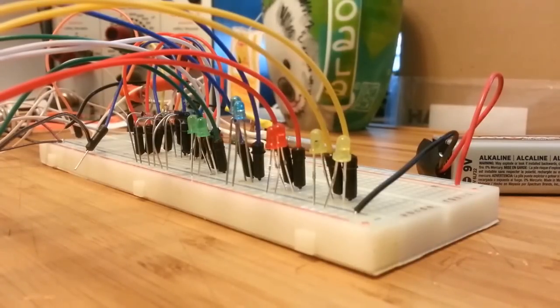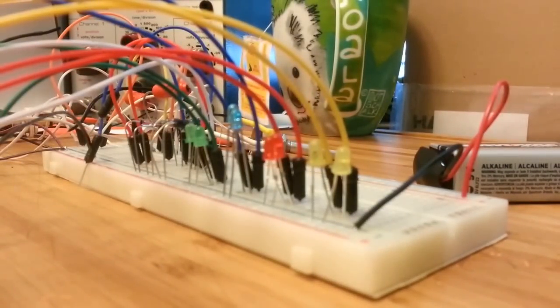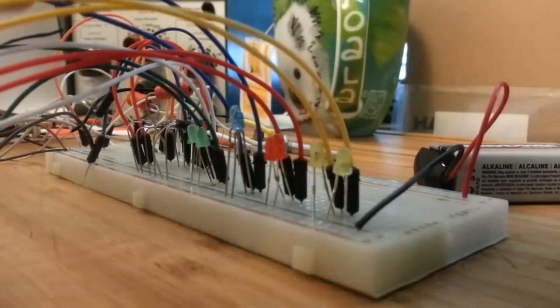Right away you can tell I don't have as much volume. Take that silicon one out and we're left with just the opposing pair of germanium diodes. It's not hard to see why they call this the fuzz pedal. Fuzzes are the more extreme versions of distortion pedals. I could stop here but I've got all these others lined up.